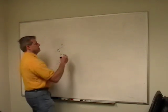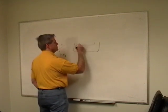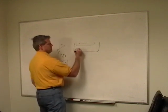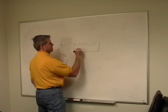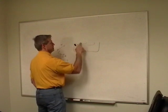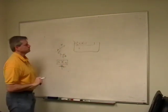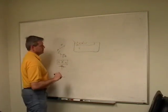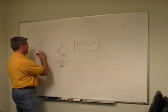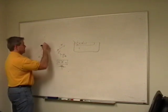Whenever you make them in silicon, what you'll see is the emitter, the base, and the collector. I take it back, I did it the wrong way. Collector, base, emitter. Something like this, with your ties, like that. And what's going on here is you're creating fields again, just like we did before. So a standard silicon NPN, back to my tech days, has a voltage drop here when it's turned on of 0.7 volts into your circuit.